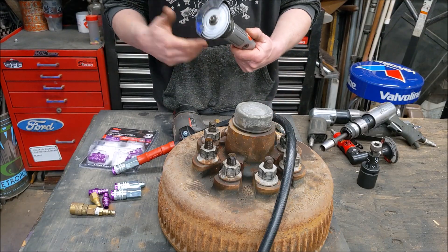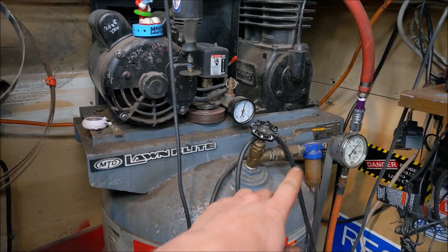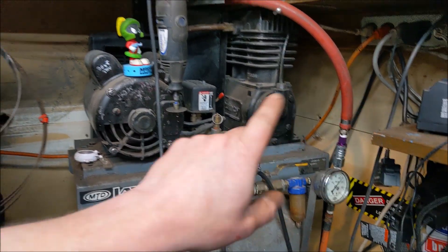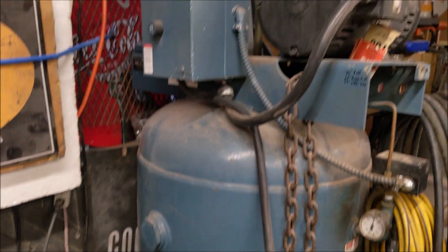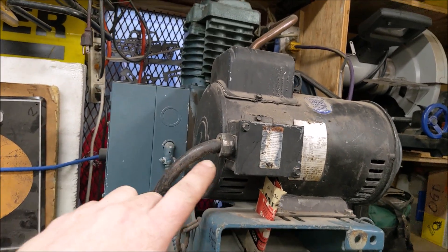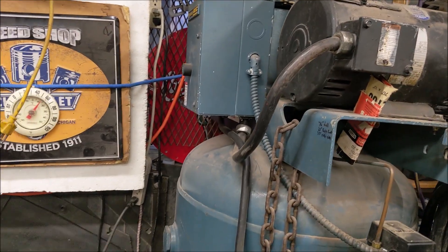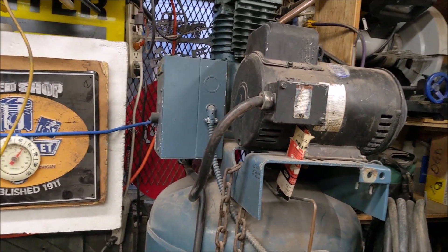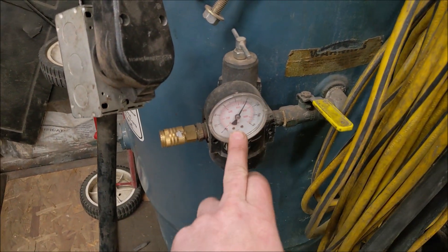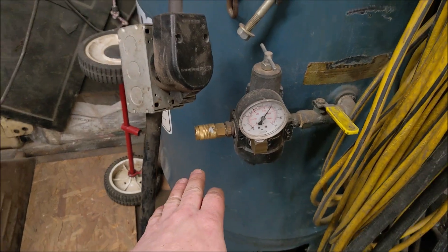You can't really run this tool for even a couple of minutes unless you have at least a 60-gallon air compressor. This is my main compressor, the 60-gallon Quincy, but the filter dryer I have hooked up on there is going to slow it down. So we're going to my 80-gallon Curtis. Seven and a half horse, 230 volts — this thing puts out so much air it's unbelievable. It'll catch up and outrun you. I'm going to regulate it at 100 PSI and run through a three-eighths hose straight to the tool.